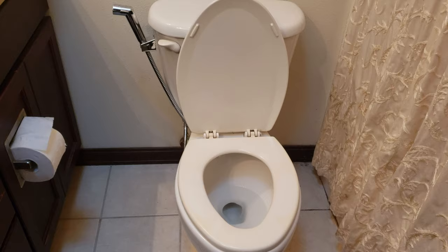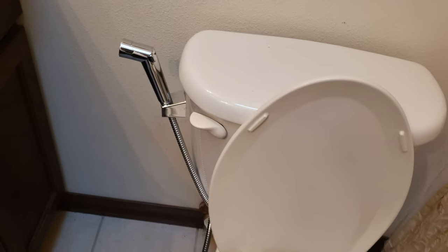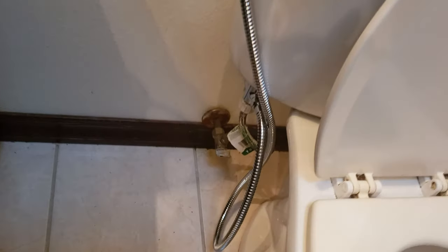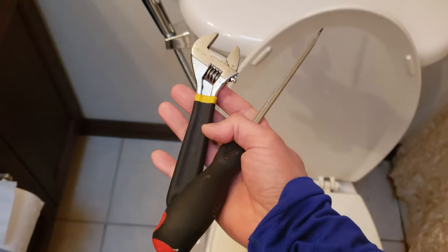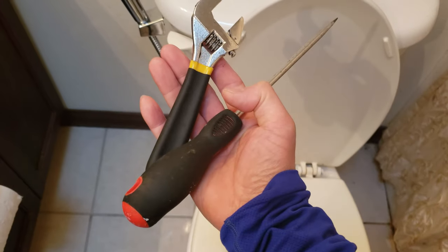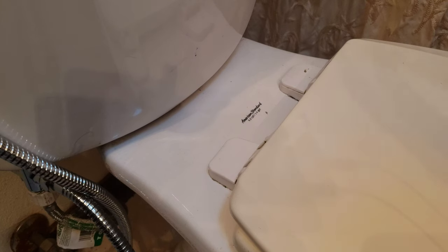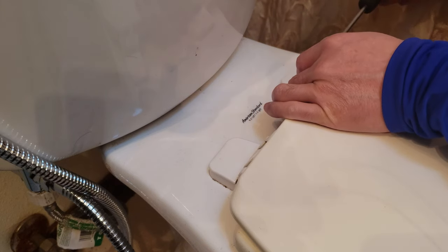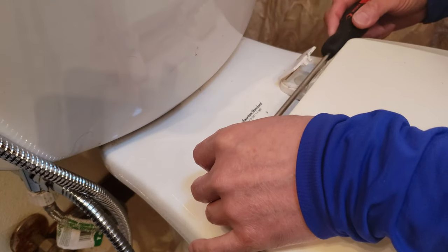Let's go ahead and install this. This is my master bathroom toilet. Don't worry if your configuration is slightly different — I have a handheld bidet here, so it's a slightly different attachment. The two tools you're going to need are a wrench and a flathead screwdriver. For most of you, your water valve will look more like this. The first step is to remove the toilet seat cover — use your long flathead screwdriver and gently push it sideways. Make sure it pops up; you don't want to force it because these can break easily.